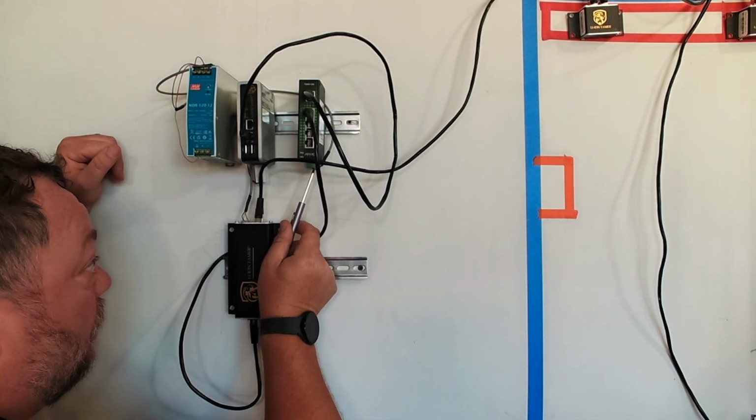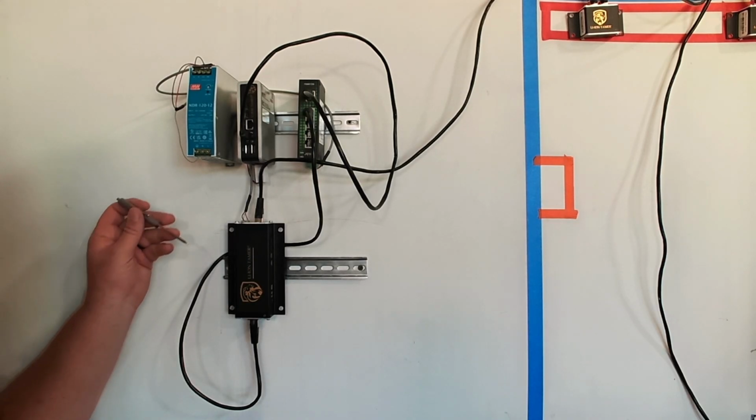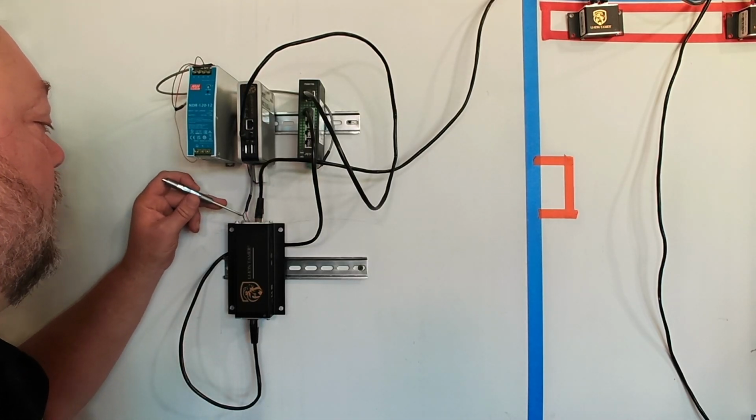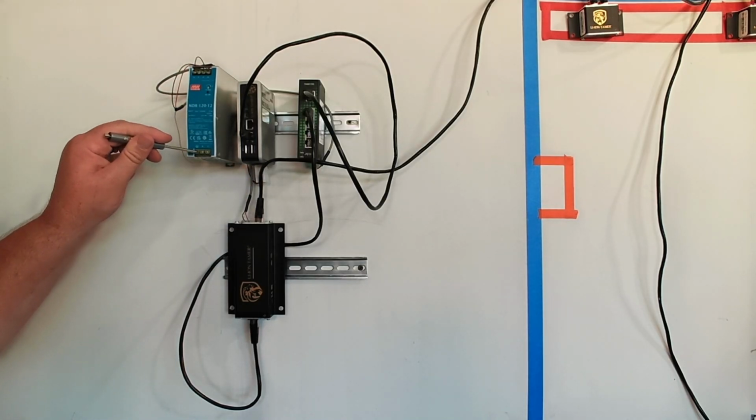I am in P1 negative, P1 positive, negative, positive. That all checks out. Move my table, because all good old fire alarm guys carry a table with them in their trucks. We have a positive 12 volts, negative 12 volts, and a ground. I can trace that ground up, and I'm terminated to earth ground.